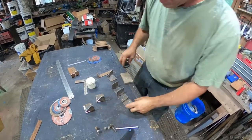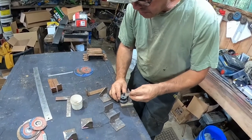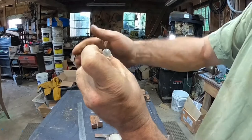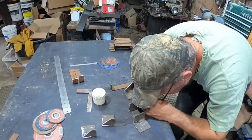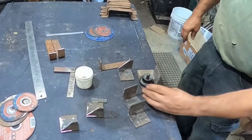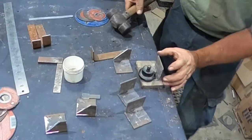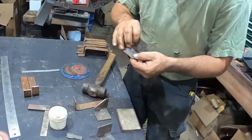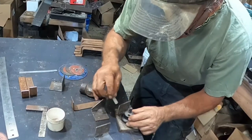This is an engineer's punch. You probably can't see it but there's a little dot in the center and you look down through it — it's like fiber optics and it centers the punch. I'll have to go get my hammer. That's centered on there — just give it one good whack. We have our center punch, and just repeat the process.